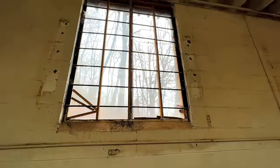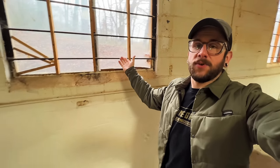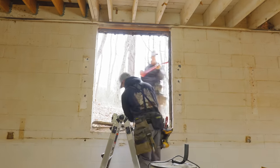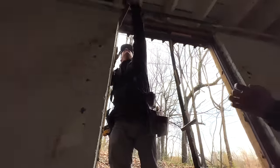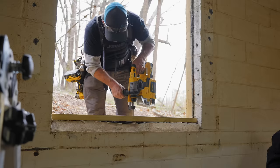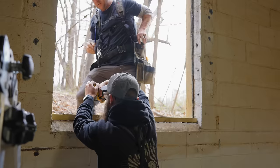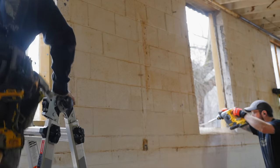The next task was getting rid of the windows. These windows are garbage — one panel is glass but the other is just plexiglass, and the security bars are not a super secure setup. As soon as the Perkins guys arrived, the windows were promptly demoed and removed. Since the walls are concrete block, we used treated material to avoid any moisture damage and fastened the plates to the walls with concrete anchors. While Ray and Jason wrapped up the first window, I moved on to the next one and started cleaning up the bottom of the window opening.